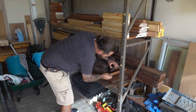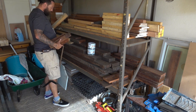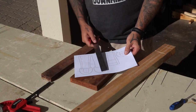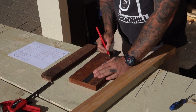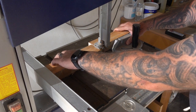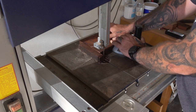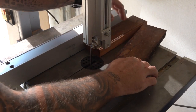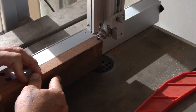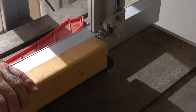So this is me trying to pretend like I haven't already picked out the pieces of wood I'm going to use. In the design I drew up, the height of these pieces was about 180 millimeters, so I'm measuring them to about 250 millimeters to make sure I have enough material to work with. The widest part of my design is roughly 60 millimeters, so I'm cutting all pieces to 70 millimeters to end up with 70 by 70 millimeter blanks. The piece I'm going to sandwich in the middle I want to be roughly 10 millimeters thick, so I'm cutting those to about 15 millimeters so that when I plane both sides I end up with roughly 10 millimeters.